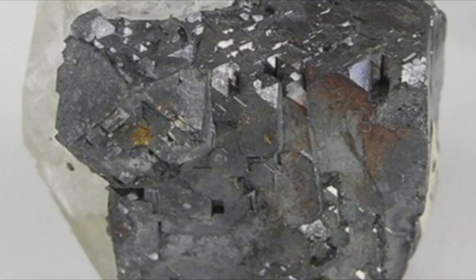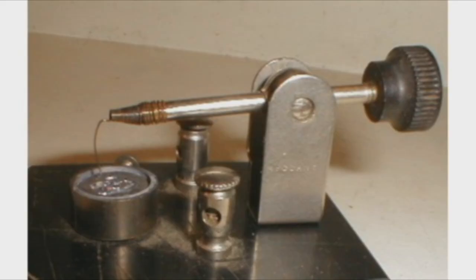The name 'crystal' comes from the fact that the detector of the radio is a piece of crystal, usually galena. Another name for the detector would be rectifier or diode. We used a diode in our kit here from Vectronics. Some of the earliest sets used what they call a cat whisker, which was a little piece of wire that would come in contact with the crystal.